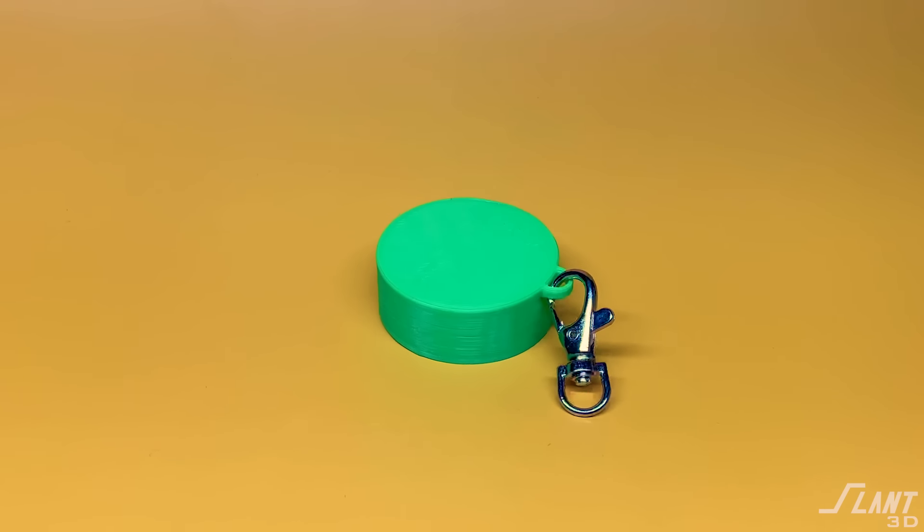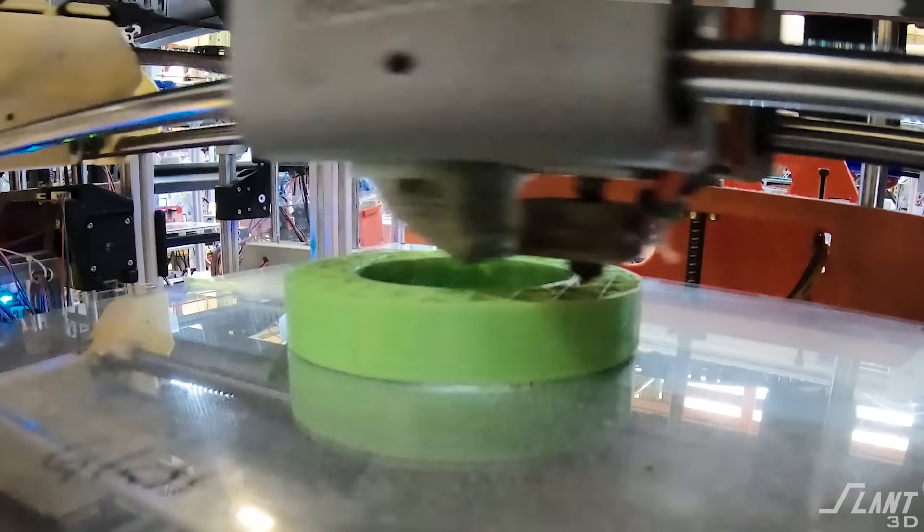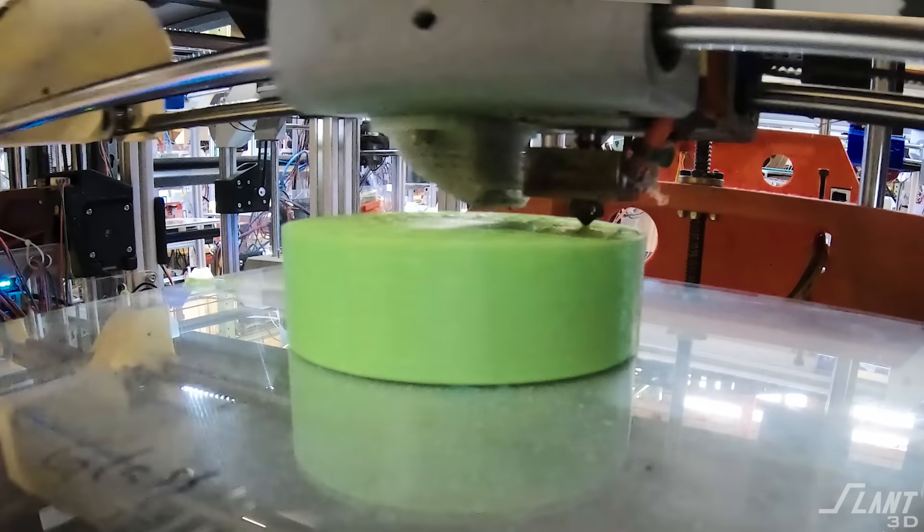The very first rule of making lids is that generally they are smaller parts, so make sure you put chamfers on all the corners that are on the first layer at least, and make sure you round out any vertical corners on the part. This ensures that the part is as efficient to print and comes out with the highest quality consistently, because when you're making 10,000 parts there's a likelihood that something might go wrong, and doing these very small design changes reduces the probability of those things going wrong, which reduces the cost for the client and improves the quality of the parts overall.